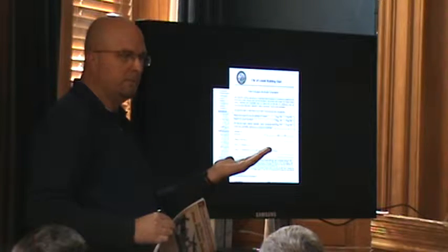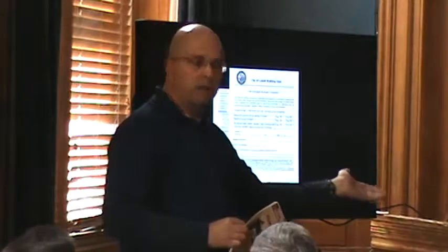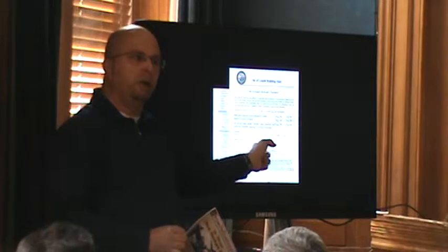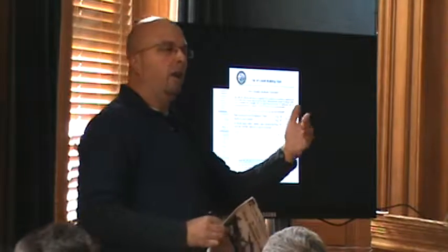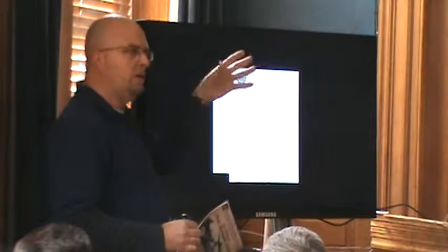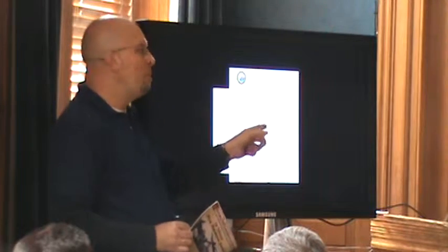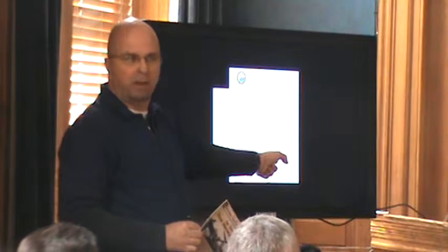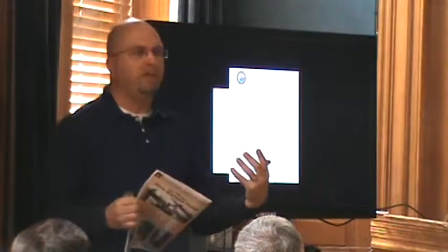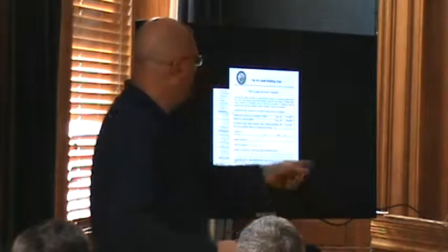And as soon as they go 'what?', there's a problem with the fire escape. They can hire an engineer to do that process, or hire a local inspection company to perform it for them. What this does is put a little burden on the ownership to make sure, on one-year inspections, that their fire escape is in good order. Every five years, it's a professional who's going to verify that everything is structural. But nobody's doing one-year inspections until they have a five-year done and are certified — you can't perform the one-year until then. But as a test on your commercial abilities, you should have them basically test-drive the fire escape system to make sure it's fully functional.